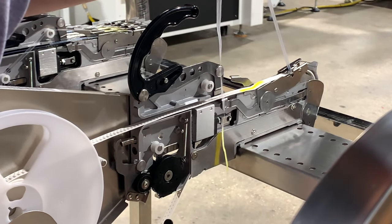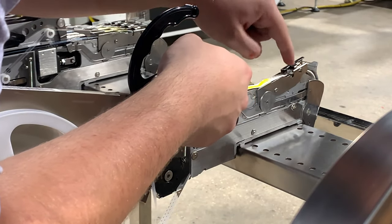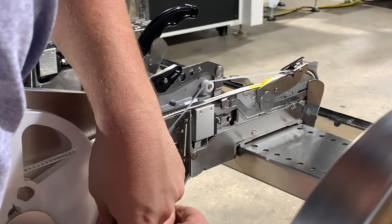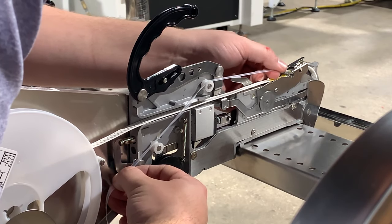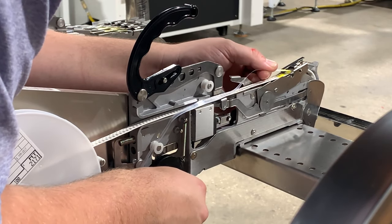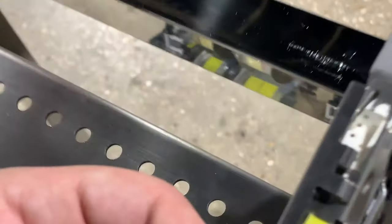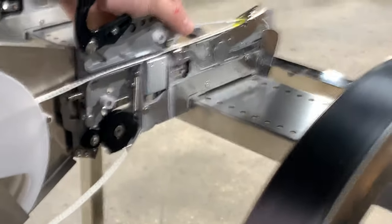Once it's out at the bottom we can grab it and pull it, which makes it much easier to advance. We want to make sure we maintain constant pressure on this film because we don't want it to get caught under this part and go down with the tape. We'll route it as if it were in operation and maintain simultaneous pressure on both the tape and the film. We are now approaching the point where our feeder tape meets our actual cut tape, so we're going to very slowly advance this, making sure that the film on the actual cut tape is still properly attached to the adhesive tape — and it is in this case.